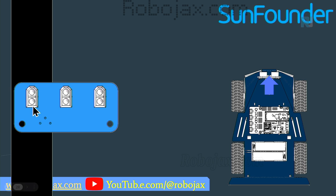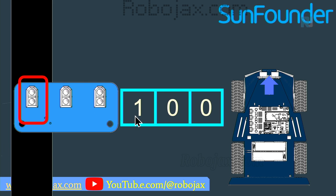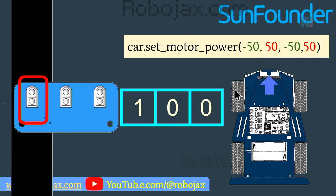Now, if we have only one sensor on the path, then we are reading 1, 0, 0 like this for each sensor, because these two are outside and we will get 0. Then we move these two wheels forward using this 50, 50, and these two wheels backward, -50, -50. As a result, the car will rotate sharply to the left with a sharper angle, which will quickly correct the path and get it back on the line. And this is how the car stays on the path.